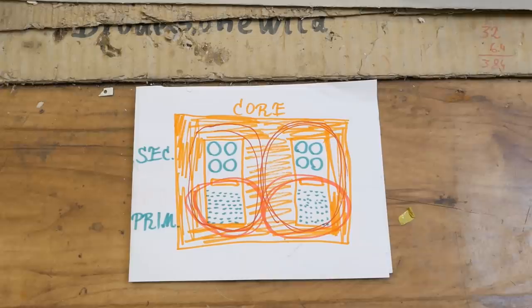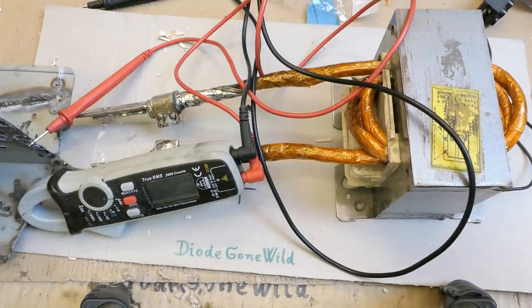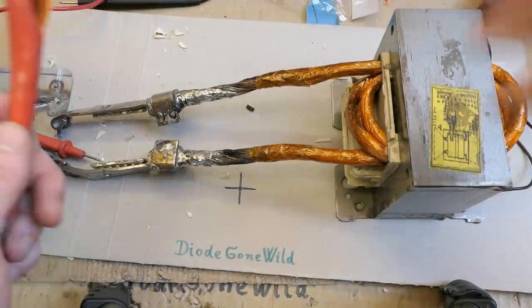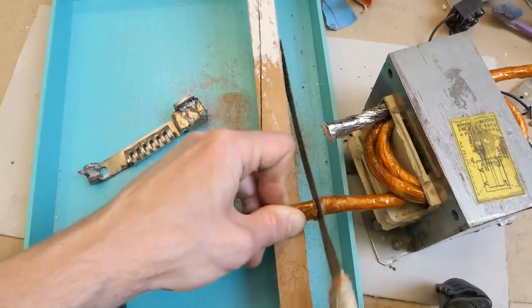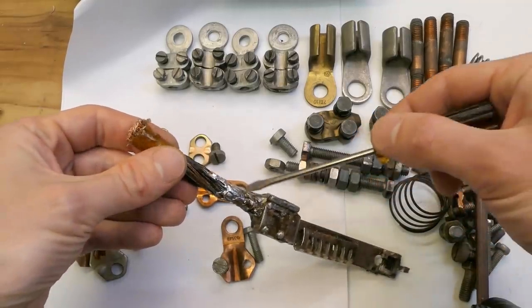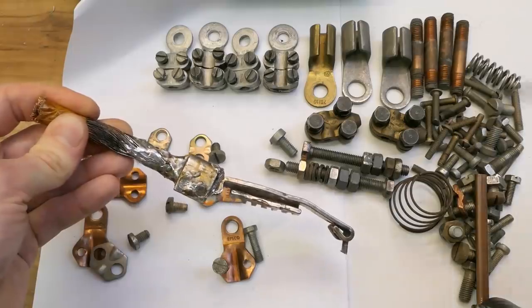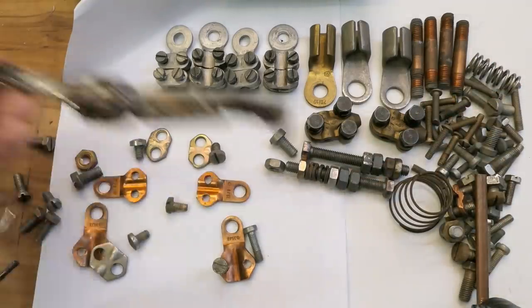So removing the small magnetic shunts doesn't really increase the current much. When the transformer is loaded by the spot weld the secondary voltage still drops significantly below half of the open circuit voltage. It seems I need fewer turns on the secondary but thicker wire — I will try three turns instead of four but with about 50% extra strands in parallel. Soldering wasn't the best idea because it's not easy to solder such thick wire, the next one will be even thicker, and it's hard to modify then. Those permanent copper tips are also not very useful because they wear off and can't be replaced.